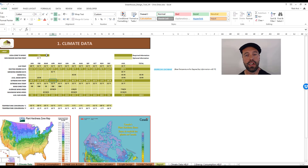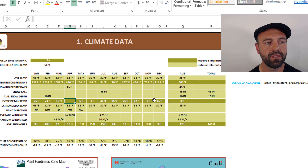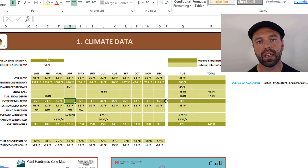If you think of a greenhouse as a novel ecosystem that's a little out of place relative to the ecosystem around you, you can use the data from that USDA zone to figure out what your minimum criteria actually is. So if you live in USDA zone 3a and you're trying to mimic zone 13a, achieving that 13a environment means you can grow plants that share that same USDA zone. For this student, mimicking zone 13a basically means keeping the greenhouse at 65 degrees Fahrenheit. They've also entered their extreme minimum temperatures, which helps the model calculate extreme heat loss and size the heater appropriately.